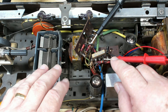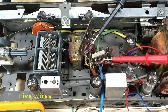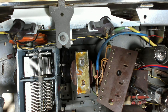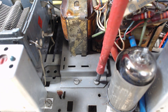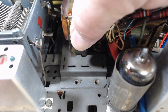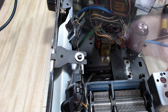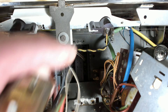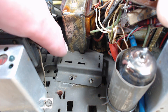Now having re-familiarized myself with this, it's going to be easy - it's just really four wires on each transformer. I'll try and remount them. I think this bracket comes off and reveals mounting for the larger transformer. Let's have a look - we'll get this board out of the way. There are two screws there. It looks like it just slides in on that side, so I'll undo the two screws. I should be able to slide that sideways. Okay, and there's the new one. Hmm - it doesn't fit very well. It doesn't line up with any holes that are in there. I thought it might line up with some of the old holes. It might be better to mount it back on this bracket - I'll take the transformer off the bracket and mount it back on that.